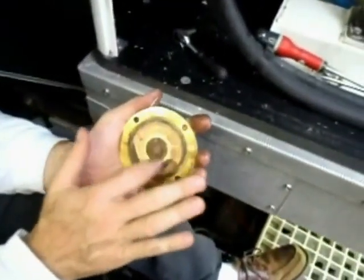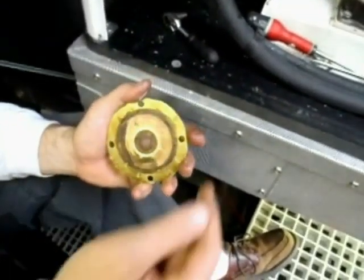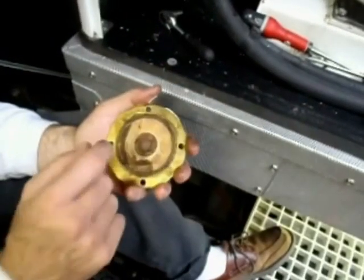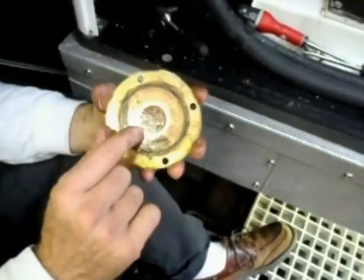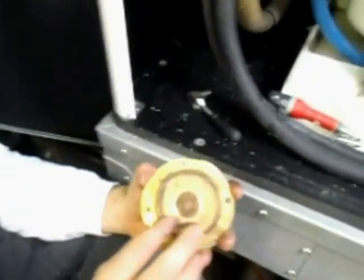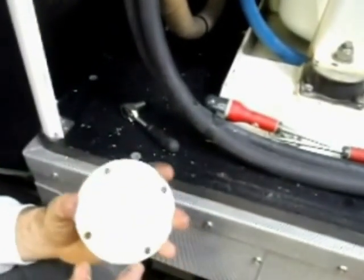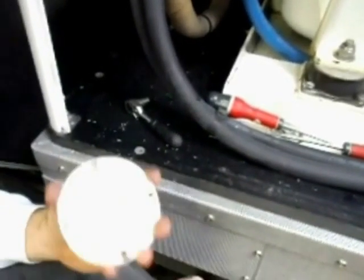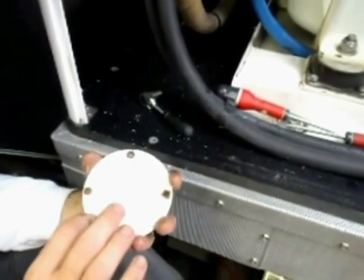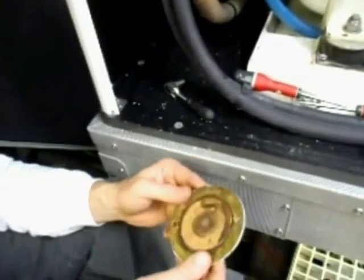This plate right here is the plate that the front of the impeller is rubbing against — this plate is part of the seal. The water doesn't want to go around one of those rubber impellers and back the other direction. When we look at this plate, we feel for how deep these grooves are. Once the grooves get worse and worse, you knock the paint off this side and flip the plate over and you get a whole new sealing surface — a second run at sealing. Once both sides of this pump plate have been worn, then we need a new pump plate.